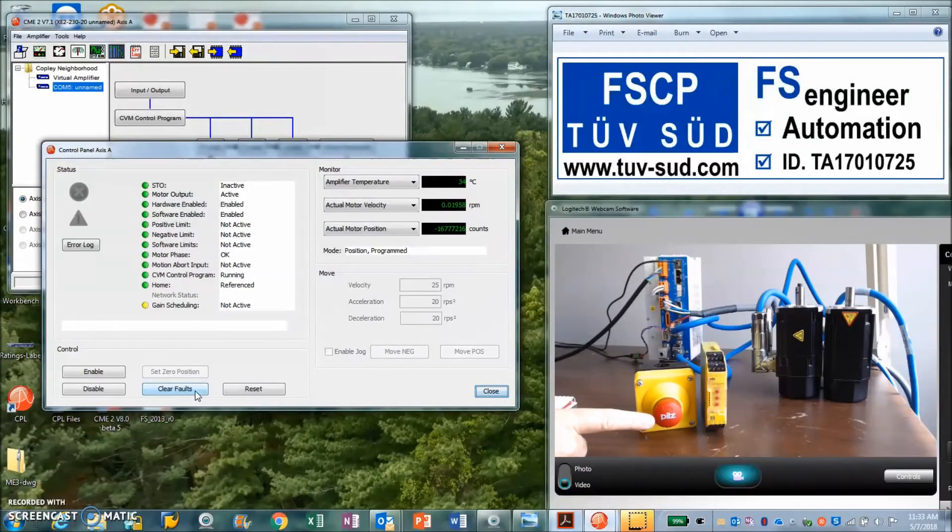Here I have a safety switch — this is not just an ordinary button. It's designed by the safety specialists at PILZ. You can't just use an ordinary switch; you have to use a safety-rated switch for your safety circuit. This is also a safety relay — PILZ makes a safety relay as well. The hardware is designed to be safe, and any software used to configure it is safety software. These things get connected to your drive.